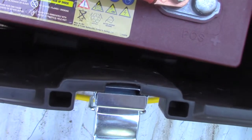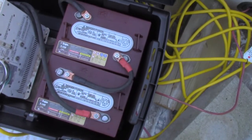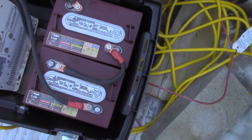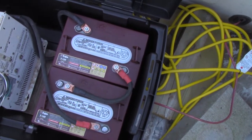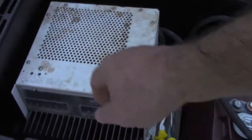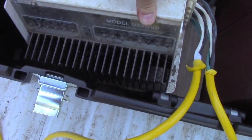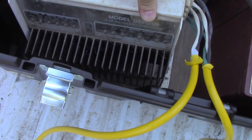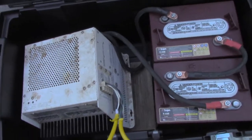It's better to have the same or a little better capacity — this is 225 amp-hours at the 20-hour rate. That's better than a pair of 12-volt batteries because using 6-volt batteries you run them in series to get the 12 volts. The built-in charger is a three-stage charger: it bulk charges, and then once the bank is fully charged it goes into float charge mode, dropping down to about 13.2 volts, which just maintains it.